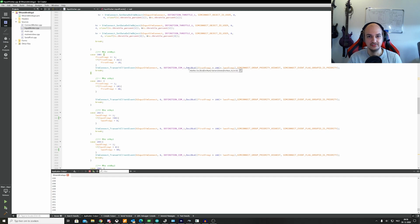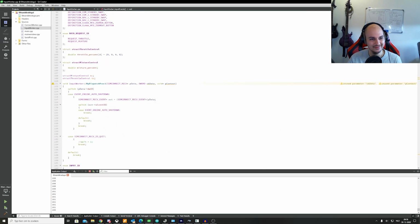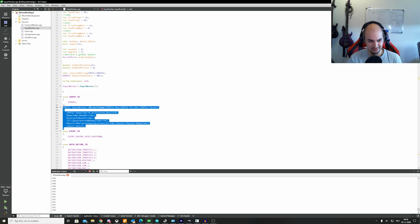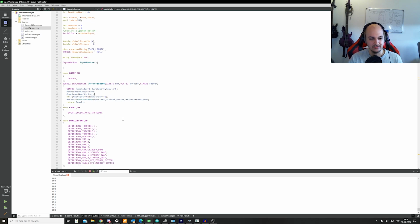So what it does, it changes the decimal coming in to a BCD16. It's a binary coded decimal with 16 bits. It's quite a complex formula. I found it on the internet. I'm going to be honest, I'm not that well versed in these kinds of functions. And it's just going to give us something like 0x00123, which stands for 123.000 on your frequency. So it's a bit more complex code. And we're going to see how you guys think it works now, and if it needs some improvements, then just let me know and I'm going to look into how I can improve this for you guys.